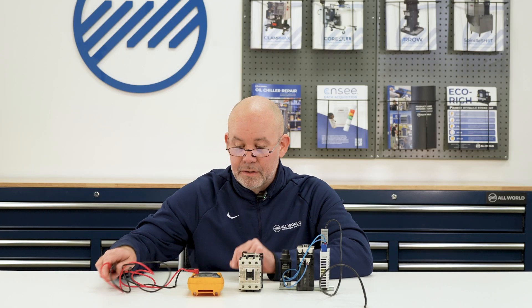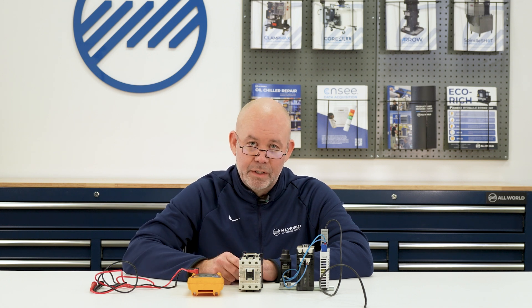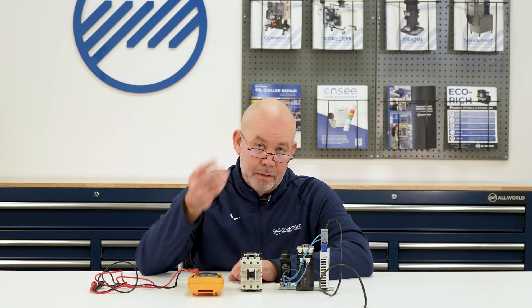If it's not, chances are there's a problem further upstream — whether it's a control relay that operates the contactor, or if there's a PLC in the picture that controls the control relay which controls the contactor, the PLC may have a problem. But provided we make this check at the coil and it checks out okay, now we have to go down into the contactor itself.